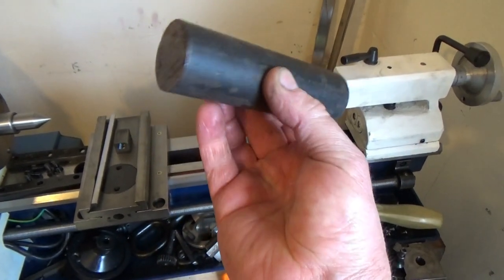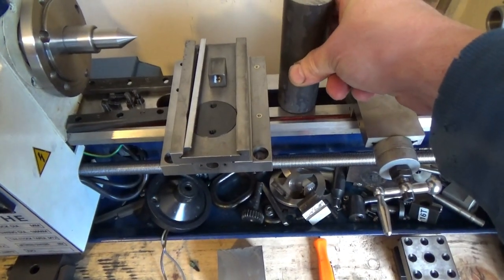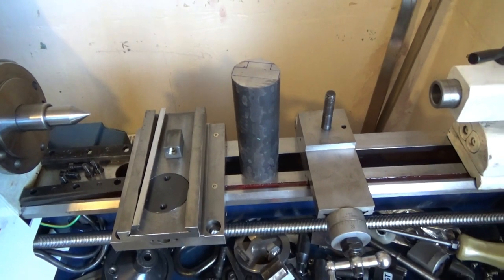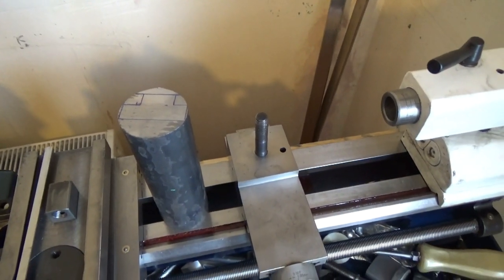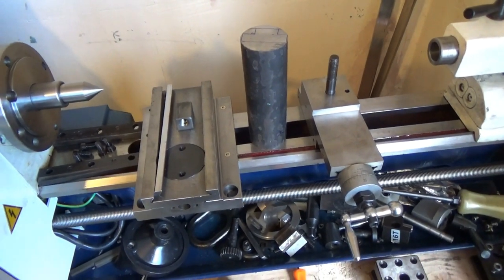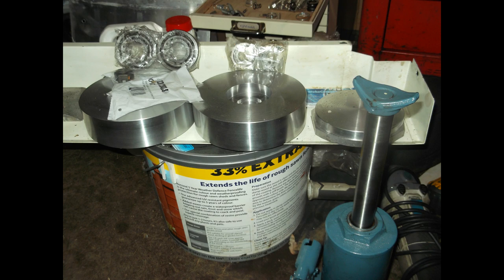I've elected this piece of steel to be the carriage lock. I'm going to cut it down to that mark, which should give enough to go the full width of the carriage, then mill it to make a T-nut kind of profile. It fits inside with loads of clearance and a bit of side-to-side wiggle — I don't want it too tight. The only problem is it might foul in one area.